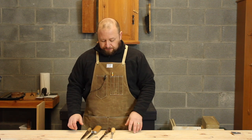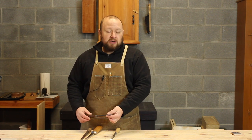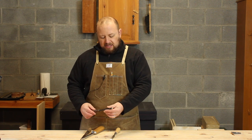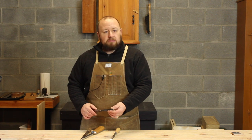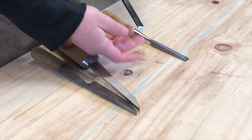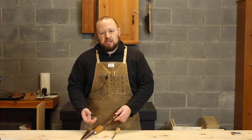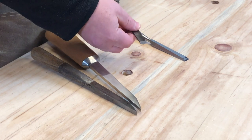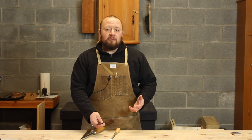I've got four different chisels laid out on my bench. The first one is called a firmer chisel. In old books it's been called a 'former' - I think the term comes from an old French word. It's an older style chisel not really made much anymore. The defining characteristics of the firmer chisel are that it's typically straight, parallel-sided, and the cross-section of the steel is rectangular. There are no bevels along the sides. We call this a firmer chisel, and it's one style of bench chisel.